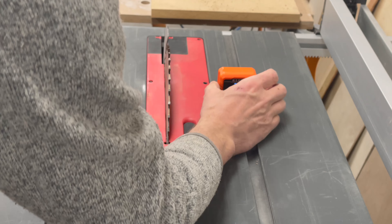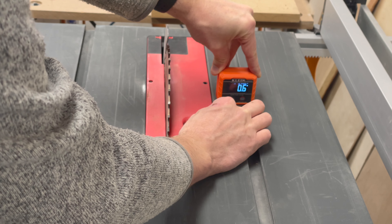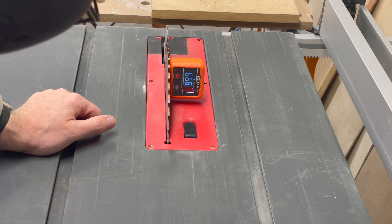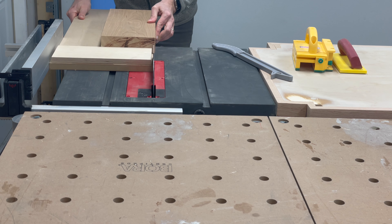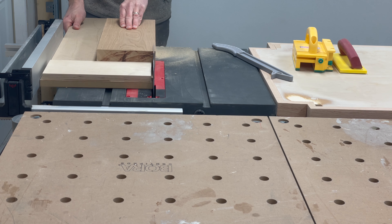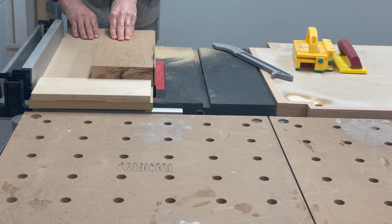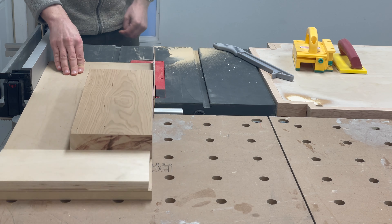It's important to verify that the table saw blade is at 90 degrees. I do this with a magnetic digital angle finder, but you can also use a square. Once we hit 90 degrees, we are good to go. You can see the edge just barely hanging off the side of the sled. I set up the fence so the MDF sled rides perfectly between the fence and the blade. Because the side riding along the fence is straight, that straight edge is transferred to the piece of cherry we are cutting.